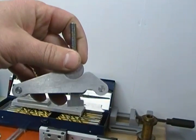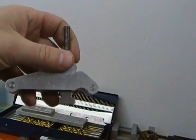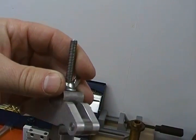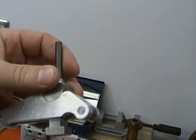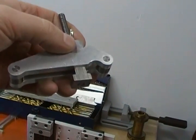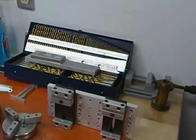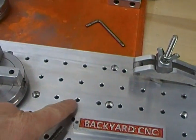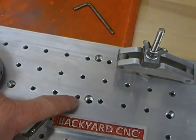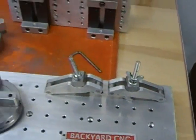These interesting little clamps have a wide clamping range of about up to two inches without the use of spacing bars on the tail end. They mount and clamp down with a quarter-inch 20 threaded rod, and I use wing nuts on them for convenience. The T-nut shown fits the T-slots on my small CNC milling machine, but the threaded rod can also be threaded directly into any of the quarter-inch 20 holes on the fixture plate, giving you a wide variety of clamping options for work.